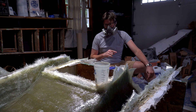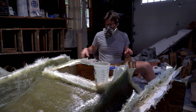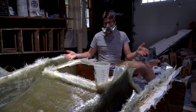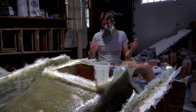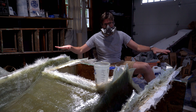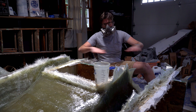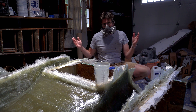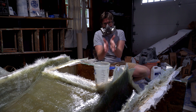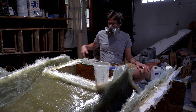I'm exhausted. I'm going to take a break and eat some food, and then I think I'll be able to get the other parts done. The back's going to go really quick because that's a big flat area. These pontoons are just deep wells — pretty labor intensive. It's easiest to put fiberglass on something flat because everything self-levels; you can pour the resin on it. Vertical is harder, and the pontoons are pretty much completely two verticals. After a little break to give my back a rest, we'll get the rest of it done.